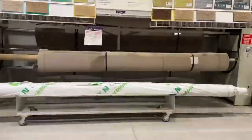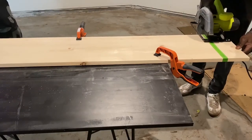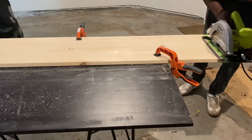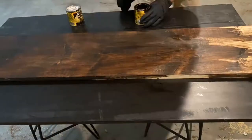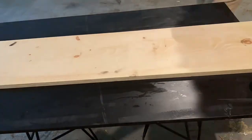We are moving on to the installation of some floating wooden shelves. I made a quick trip to Home Depot. I grabbed three 12-inch by six-foot boards. We lightly sanded each of these boards, cut them down to 68 inches, which is two inches shorter than the width of our wall. We stained them first with ebony and then with a black gel stain, both by Minwax.